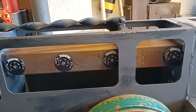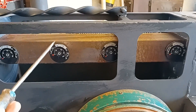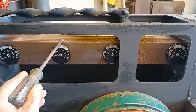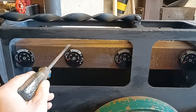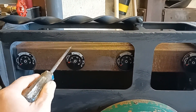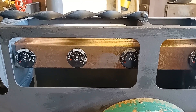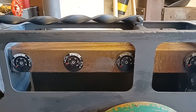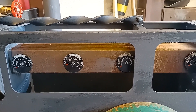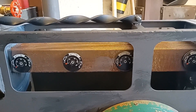The cold heat exchangers seem to work out fairly well. One thing I'll say — as soon as it gets to about this point here the temperature gradient stays about the same, so there's a chance the cold heat exchanger is actually too big for the heater size. It might change on a hot day when it's struggling to lose heat, but I'll find out this summer and that will give me a better gauge on the size of the cold side.